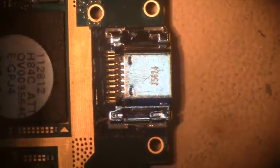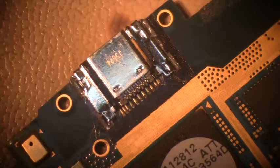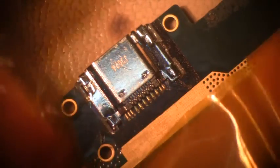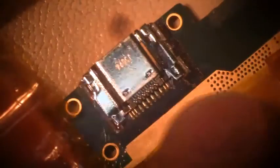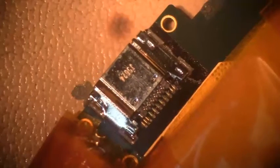The next thing I'm going to do — and I'll turn this a little bit so I can work with it easier — is put on a heat shield, because there are other parts in that area and I don't want to reflow them. I come down in here and apply it right where all these other parts are. Then I tape it down so it doesn't move but also doesn't interfere with anything. There I have it in place — I'm protecting everything.